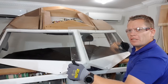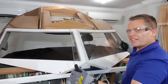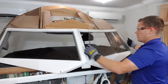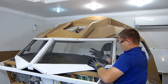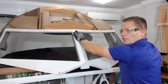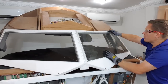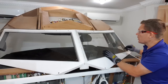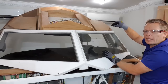Here's the sheet of glass, it's three millimetres. I did intend to have five millimetre glass, but I thought three millimetres would just be a lot easier to handle. I'm going to see if it fits — safety gloves on so I don't get cut. It does fit, however what we've got is a slight bowing of the opposite side. That's because of the sheer weight of the upper overhead resting on this 18mm rather thin section MDF. So I think I'll go outside and put an eyebrow — a support piece of wood — to help pull it back and take some of the weight.